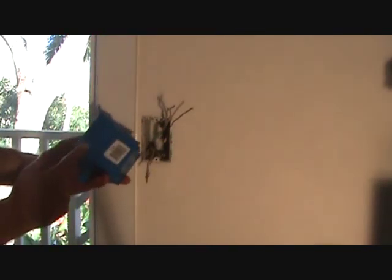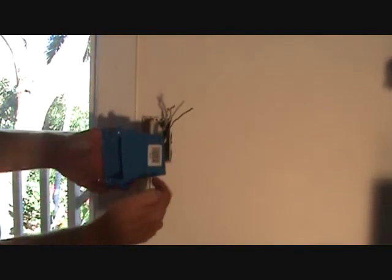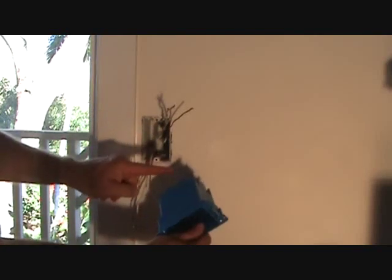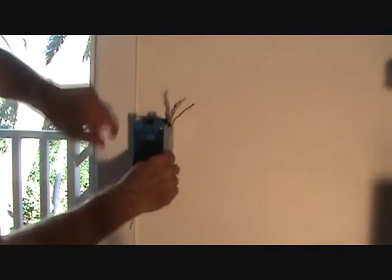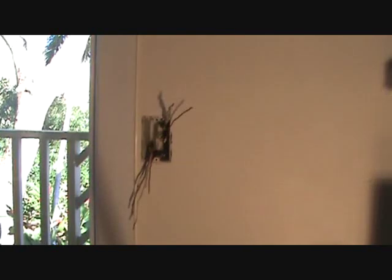Here's a single gang box. This is not the box that's in there, but it's about the same. This is a cut-in single gang box — I'm just showing you this for demonstration. This box has a nail that goes in right here and up here, and it sticks out on this side, so they put that up against the stud before the sheetrock and then pound it in. Right into the 2x4. So I know there are 2 nails in there.